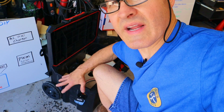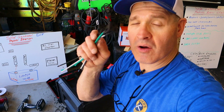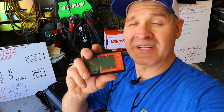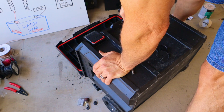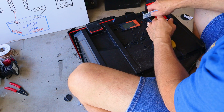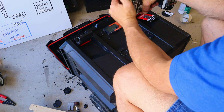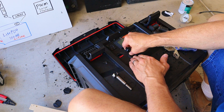Both charging ports are cut. Now I'm going to cut holes for all the output ports. I'll have AC power out from the 1000 watt pure sine wave inverter, 12 volt ports, and USB ports. I also need to figure out where to mount my battery monitor. I used a hole saw to remove most of the plastic for the battery monitor opening, then finished it with a carpet knife. For the AC outlets I used a Forstner bit and a razor knife to square them up. For the 12 volt and USB ports I drilled four holes and reamed them out with a mini drum sander to the right size.